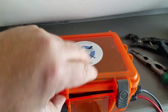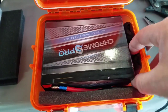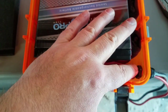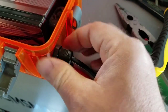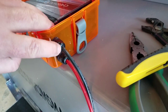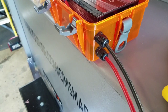Pop it open, it's got a good solid seal. I'll put a couple pieces of foam on top just to keep it locked in there even more. It's also velcroed in — probably should have just used one piece of Velcro because two is super strong. Wired up fairly clean, coming right out through the box. The nice thing about these waterproof wire plugs is you just unscrew them, and if you need to slide more wire in and out you certainly can, then just screw them back down. There's a little rubber grommet in there that as you screw down and tighten the outside nut, it sucks in right around the cables, making it fairly watertight.